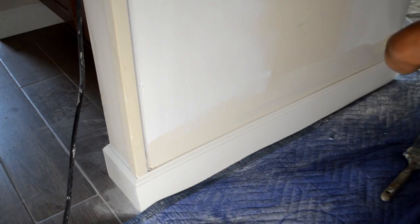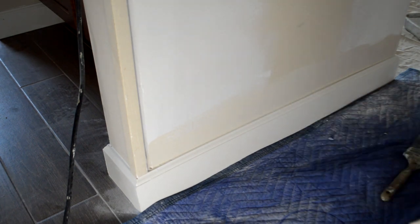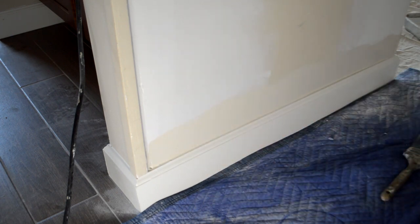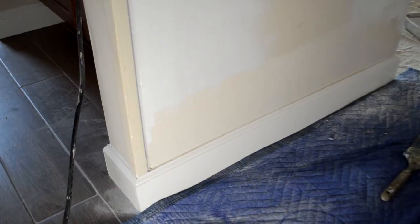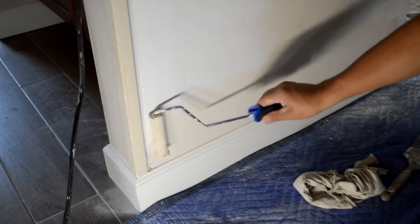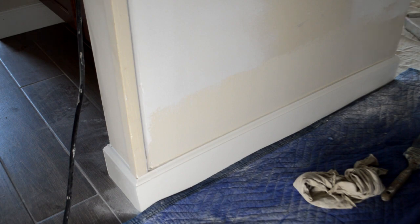If you notice I apply a little extra paint, make sure the excess paint is out. Once I know I have enough paint on the surface, I go ahead and switch to the small roller and take care of those little brush marks again. You can get really close — I actually got so close in this corner that I had to use a wet rag to remove a little bit of excess paint. But this is just to show how close you can get with a roller and how clean the finish is.